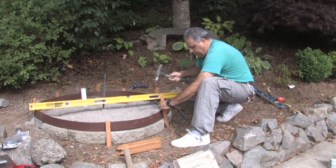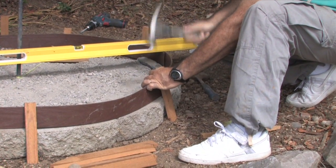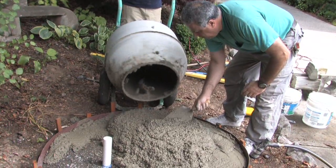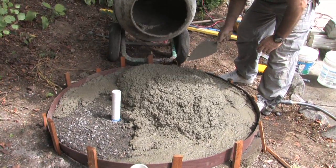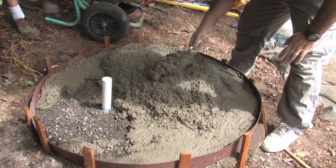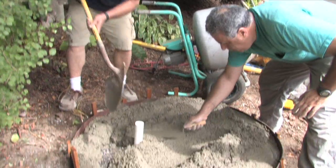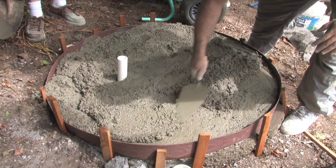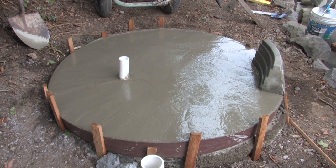In this video we're going to show how to build the base and the fountain in place. We start with framing the base for the fountain. We created a 50-inch diameter circle. I used an edger to create the perimeter and spread the concrete in place nicely. Be sure to level everything flat.